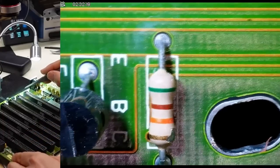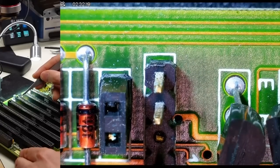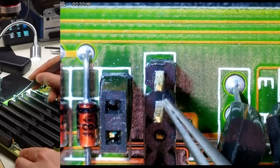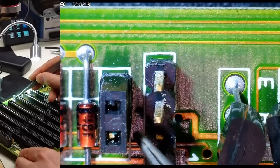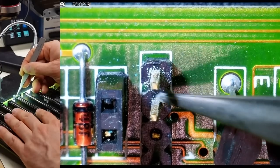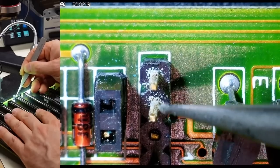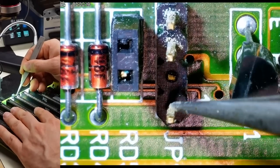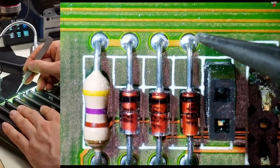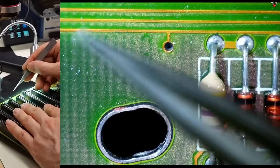If we move away from that bad area, things over here look pretty good. I can see a tiny bit of corrosion on the jumper right there, and these legs here are slightly corroded as well. It's kind of amusing — I bathed this whole board in vinegar, but it wasn't very reactive over here, but that part is pretty crusty. As we get a little further away, these diodes are in perfect shape and I'm not really seeing any more problems over here.